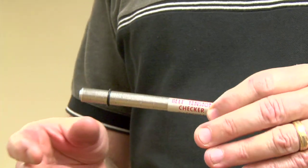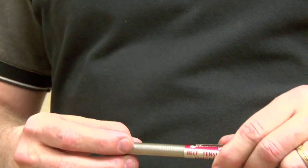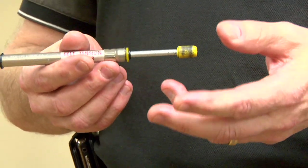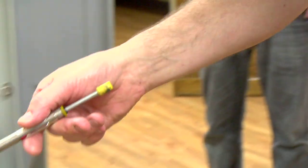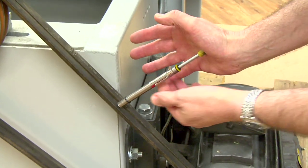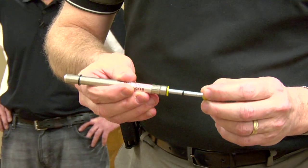On this particular drive, you look up in our IOM manual, and it says that for a three-quarter inch deflection in the belts — so you set this washer at three-quarters of an inch — we're supposed to have between 15 and 22 pounds. For a used drive, that would be 15 pounds tension. All you do is go to the center of the drive between the pulleys, push this in the middle, and push on this spring until this O-ring lines up with the other belt.